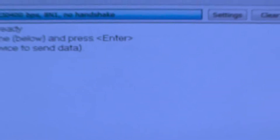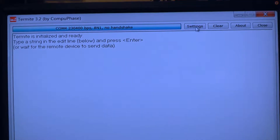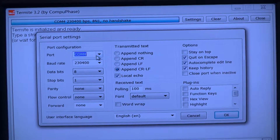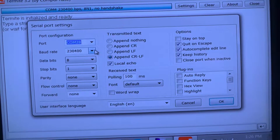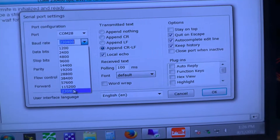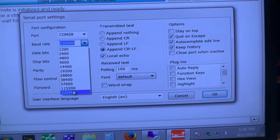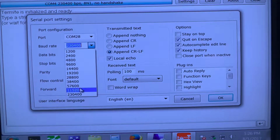That's it. Open up your terminal, choose your COM port, and you can test any baud rate. In fact, you can try to determine the maximum baud rate that this module supports.